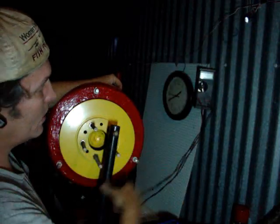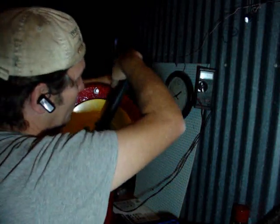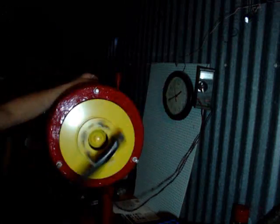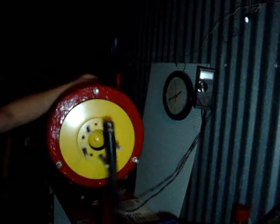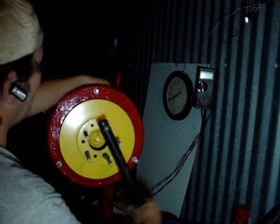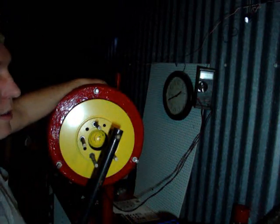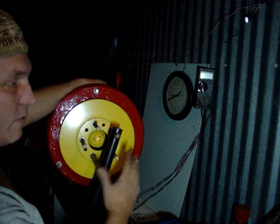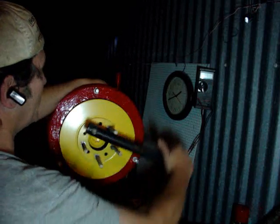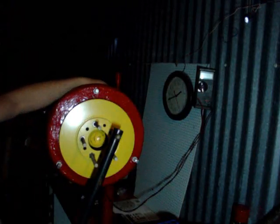That prop is going to be ten foot — actually five-foot blades, one on each side, maybe three blades. It's going to have decent torque because of the length of the blade. As soon as I unplug this it spins around real free. We designed this for 120 RPMs for that prop, and in a nice low wind it's going to be doing 120 RPM, cutting speed, having its lift — it's going to be ready as soon as the wind blows.